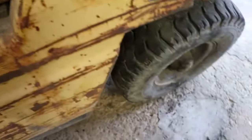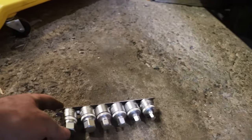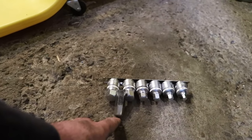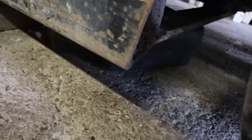Unfortunately, they've used a hex key plug on the bottom of the tank that is not removable. I think it is 15 millimeter, but I'm not certain. What I did was I took a 5/8ths bar stock and just ground it down to 15, because my hex key set went from 14 to 17. I don't have 15, and 5/8ths is 16. So between these pieces, that's more or less a full metric set. But it didn't work, unfortunately.